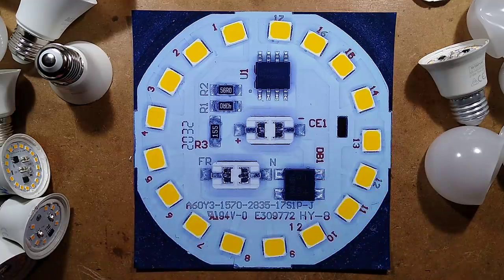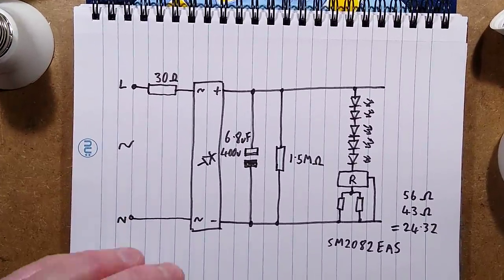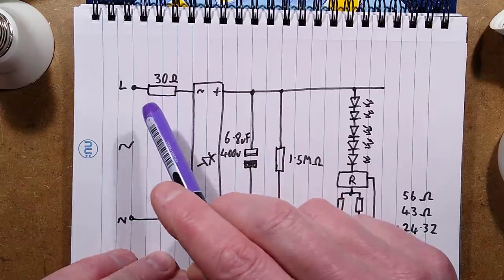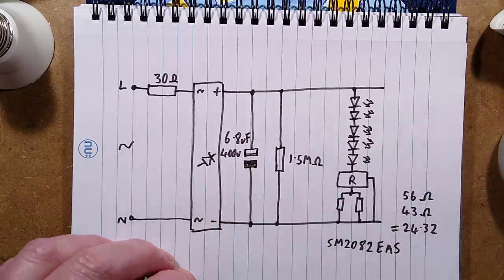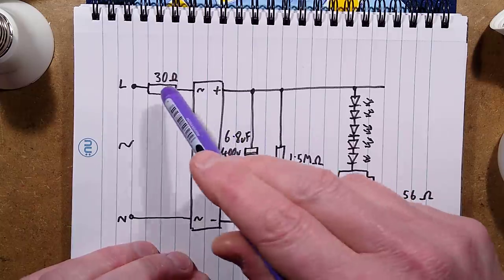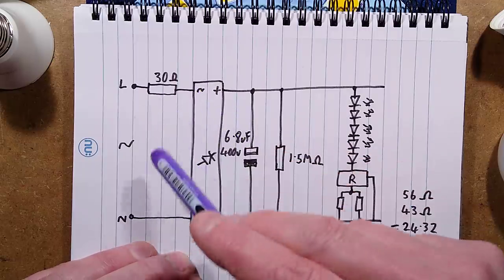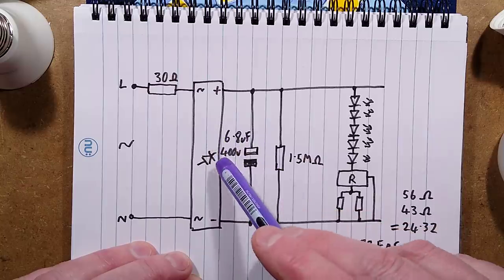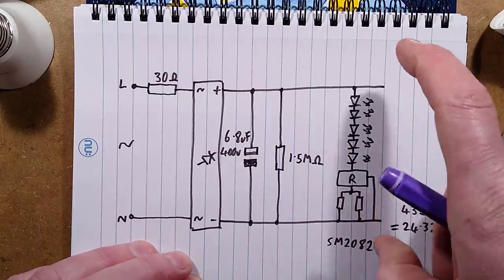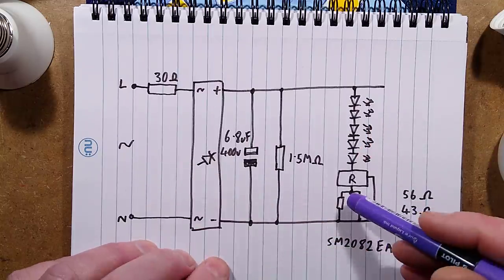Let me show you a quick doodle. The incoming supply goes through a 30 ohm resistor that reduces inrush current and also acts as a fuse - a metal film resistor that blows clear on a short circuit. This also affects the R1/R2 reading. There's the bridge rectifier converting to DC, the 6.8 microfarad 400 volt capacitor to smooth it, and a discharge resistor to decisively discharge the capacitor when unplugged so the lights don't fade out, and to prevent residual glow through capacitive coupling in switch wiring, particularly in two-way switching.